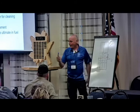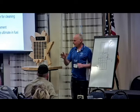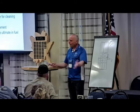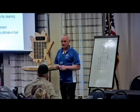Now let's take away this flue pan, and imagine this is my whole evaporator. We've got 30 Brix coming into the flat pan where we just made syrup, and we've got our 67 over here. 30 Brix can dissolve nitre off the pan. So by switching ends, we were able to dissolve nitre again, and so it was more effective than what we used to do. That sort of makes sense. So we work everything together as a package.